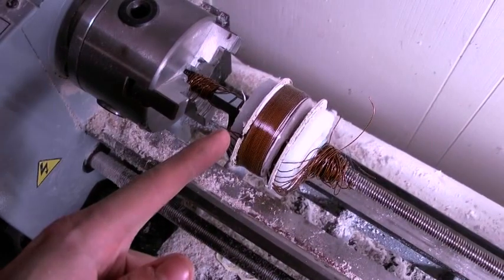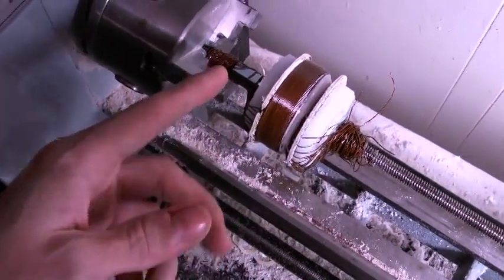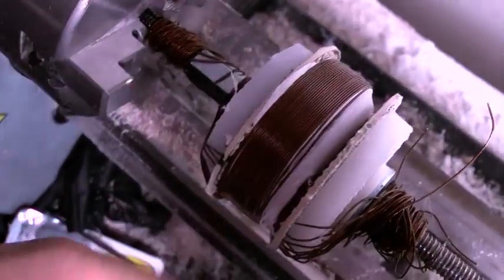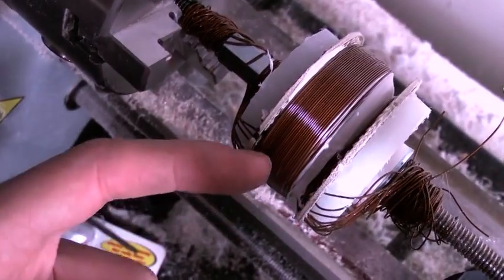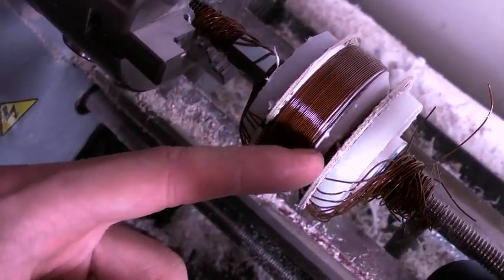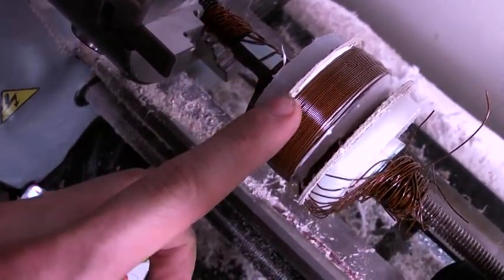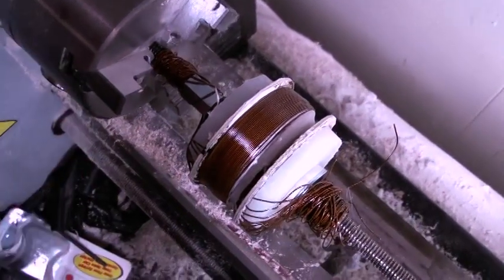Regularly when they make windings they go back and forth, but we're actually cutting it each time - not going back and forth. We're cutting it, flipping it over, cutting it, flipping it over. The reason we flip it is so we don't get this gap. You can wind against the wires easily, but once you reach the end it's very hard. By making a winding pattern where you're always filling the gaps, the gaps aren't always in one area - they even out. So you basically end up with no gap. That eliminates the entire gap problem.